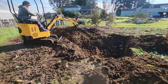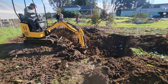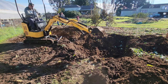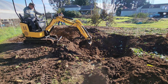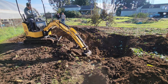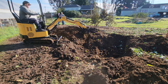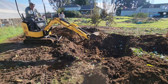So at that 5-hour mark, you drain that oil and put new oil in. It probably wouldn't be a bad idea to change it out again at the 10-hour mark, just one more flush to make sure you're getting all those little particles out of there because of that lack of an oil filter. You want clean oil. You don't want sediment in there. You don't want metal flakes floating around because that is not going to be good for the longevity of the engine. So that's the biggest complaint that I'm reading online, that the motors are seizing up.